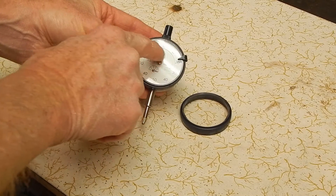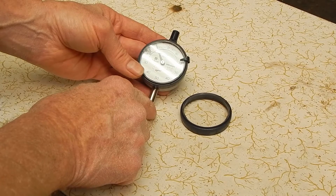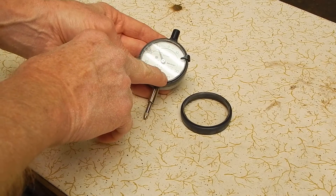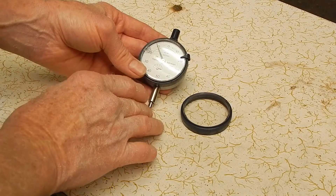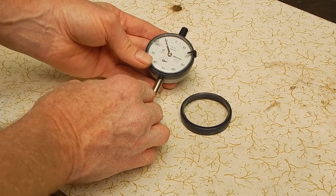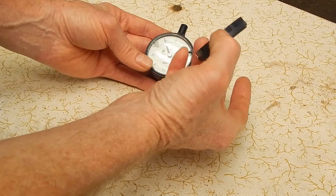The only thing wrong with it is it's got a crack in the crystal face cover. On the old Mitsutoyos, it used to be a bit of an issue — to replace that crystal you actually have to have a lens press to press in the new crystal, because it is a flat crystal and it has to be curved to fit in the actual bezel. That's why over time with the old ones, the plastic gets a set in it and the lenses can fall out. With the new generation of Mitsutoyo, and to their credit it's a good idea, you now get a replacement — you can buy the replacement bezel with the crystal in it all as one unit. A replacement crystal bezel was $10, which considering it's a Mitsutoyo and it's good quality, I think it's pretty good value.